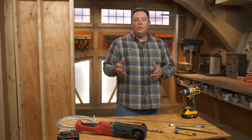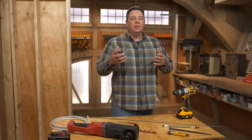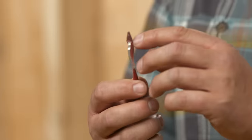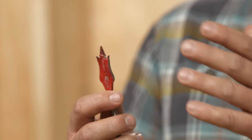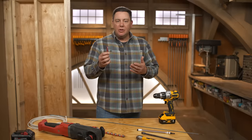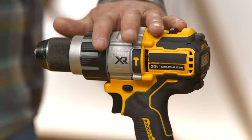If I have to drill a hole for adding a receptacle or trying to fish a line in and I only need to drill one or two holes, I'm going to use a spade bit. This particular one does have a self-feed bit — some don't, it's up to you. It's meant for drilling a couple of clean holes in smaller, tighter locations, and I'm going to use this drill for that.